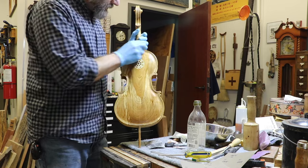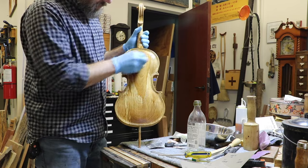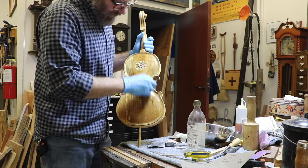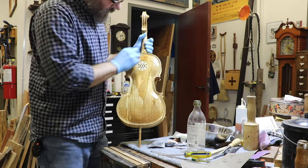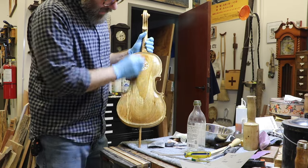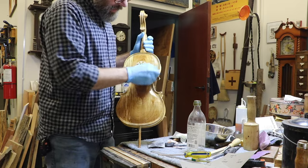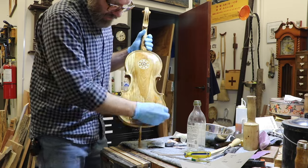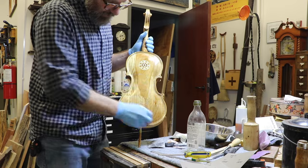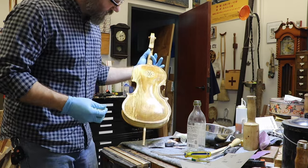and I'll repeat this for about 10 to 15 minutes total. Recharging my pad when I need to if it gets dry, and re-oiling it if it starts to stick in any way. Okay. So I'll just keep working my way over this surface with overlapping strokes. And then as the alcohol is running out, I slowly start adding pressure, and that smooths together any inconsistent strokes in my process here. Do little figure eights over it. Anything else? So that'll be the back. One little coat.